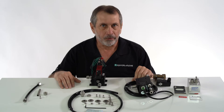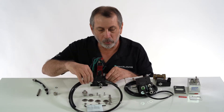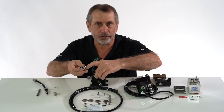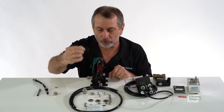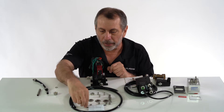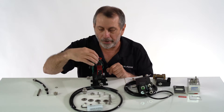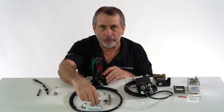When you purchase a 5500 manifold you will get several items. What you get with this kit is PUR tubing — this is 3/8 inch tubing — tube inserts, a bulkhead fitting to get your air inside the enclosure, and this bulkhead fitting has a seal on it, four mounting screws, nuts, and seal lock washers. That is used for the feet of the valve and you mount that to the enclosure. You also get a hex key, which is used to set your needle valve for pressurization inside the enclosure, as well as warning instructions for the certification of the valve.